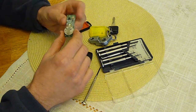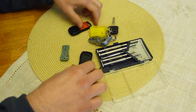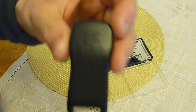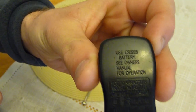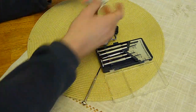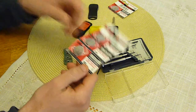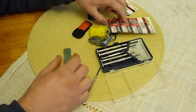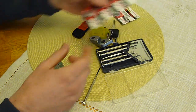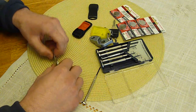What we're going to do to the circuit board is replace the batteries. The original battery that we need is a 2025, and what I did is replace it with a 2032. The voltage stays the same and the dimensions are roughly the same — think of the bigger battery, the thickness is increased ever so slightly.